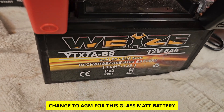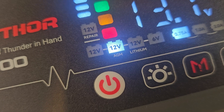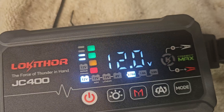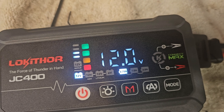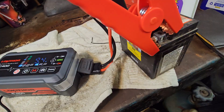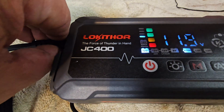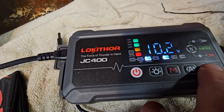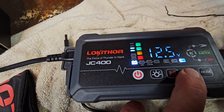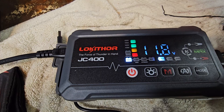Here's another old battery I have — it seems to be charging pretty quickly. We're going to hook up this 12-volt fire panel battery; it's still a decent battery, so we'll let that charge back up. This little motorcycle battery is in bad shape, so let's get it trickle charging. Plug it in, select your mode — I'll leave it at 0.75 amp. If it doesn't hold the charge, it'll desulfate.